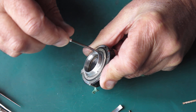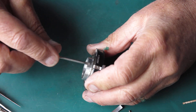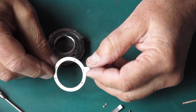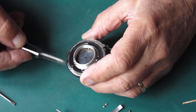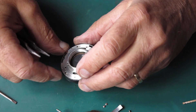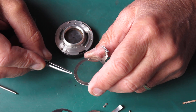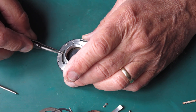It may be that the setting lever is corroded to the back of the shutter - that can certainly happen; I don't remember seeing it happen in recent times. It certainly looks like it's distorted. It's our setting lever - it's not corroded. There's the shim that goes under it, and the setting lever for our flash sync, self-timer, and diaphragm. Will it move? Yeah, the blades move - so there's something odd going on; it was displaced in some fashion. There's an odd mark at that point. The diaphragm does move; there's no problem there.